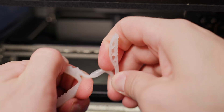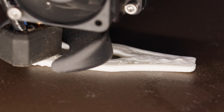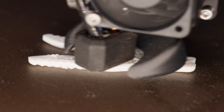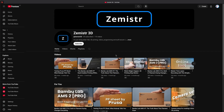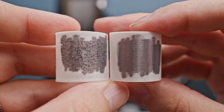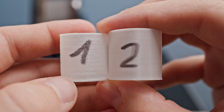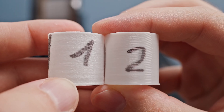But it does have a few weaknesses. One of them is that it loves water. Just a single day exposed to air and it will absorb enough moisture to ruin an entire print. That's why nylon needs to be dried and kept dry. I recently published a video testing the Bambulab AMS-HT dryer, where 12 hours of drying at 85°C can properly dry nylon and noticeably improve print quality.